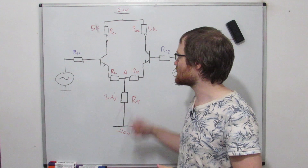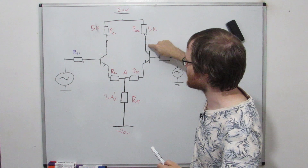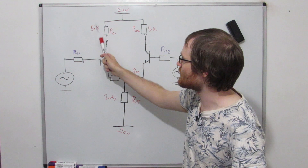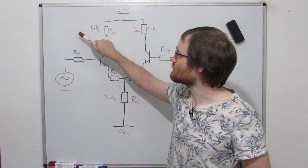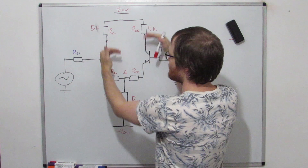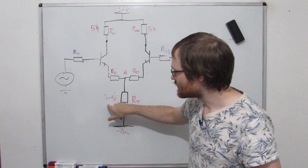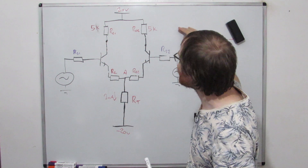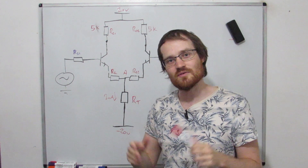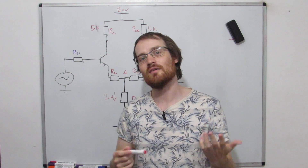When drawing the full 2 milliamps through one transistor, there's nothing left for the other. As this one draws 2mA, 10 volts drops across its collector resistor, so the collector drops from 15V down to 10V. With no current left to drop voltage across the other resistor, that collector rises to 20V. You can see how that symmetrical sharing of current gives the differential amplifier its symmetrical output. If we decrease the available current, we decrease the voltage swing and therefore the gain of the circuit.